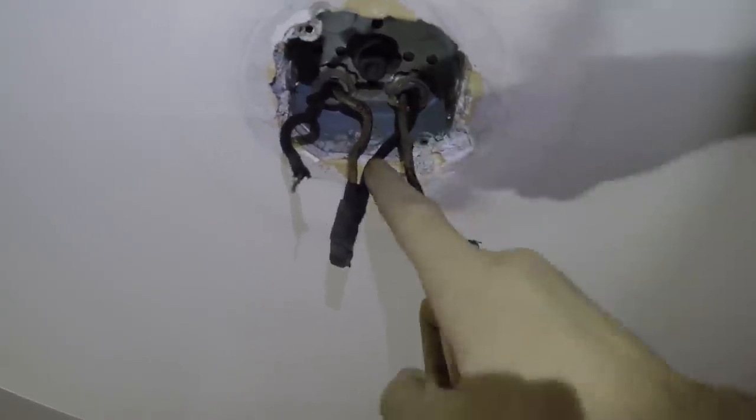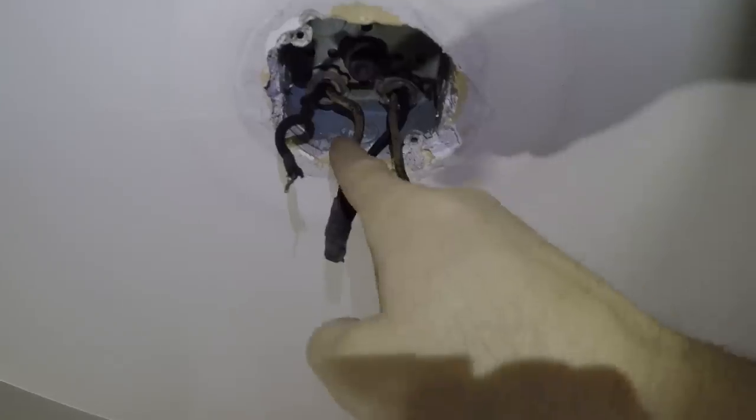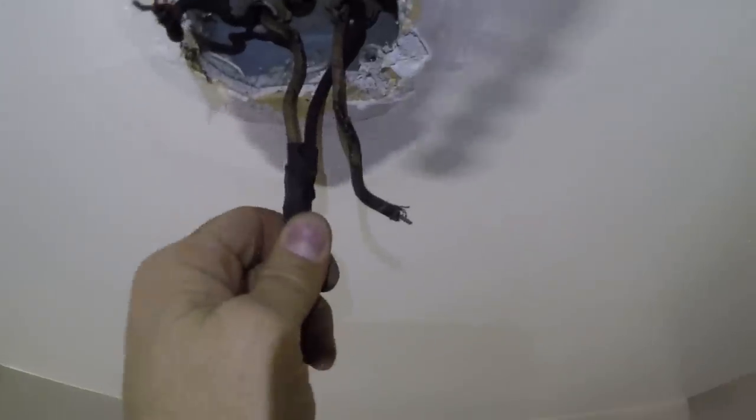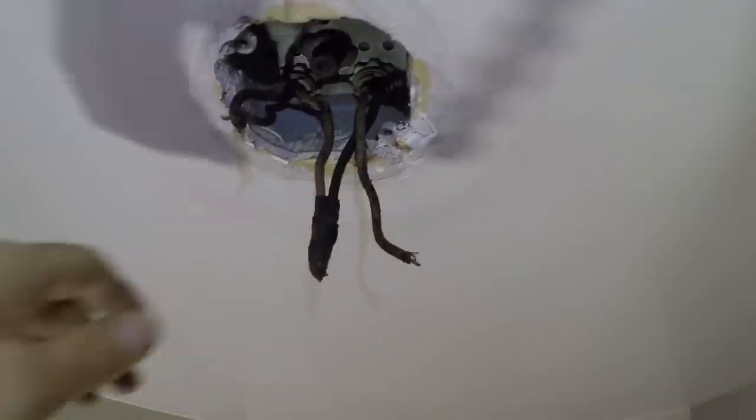So in this situation I keep getting zapped. Power's coming up to the light box instead of the switch box. Power's getting sent down on the neutral, going through the switch and coming back on this black wire here. So when I go up to the attic I've got to find this one here. Yes, people are concerned about asbestos tape — I don't care about asbestos. I put mustard on it and I eat it. People from California, you should probably just click off now — you could get cancer just watching this. Up to the infested asbestos attic we go.